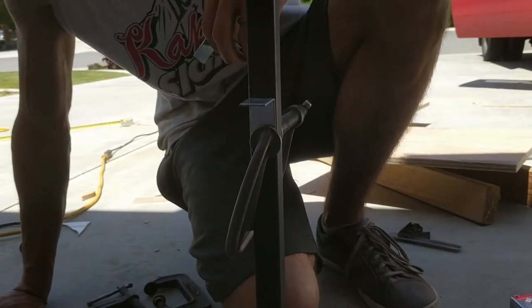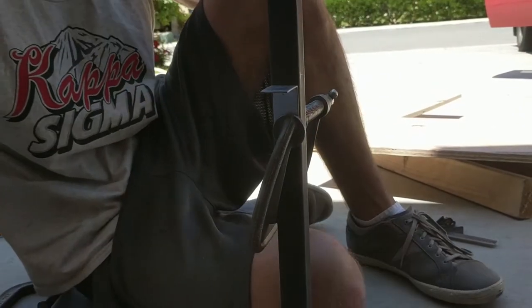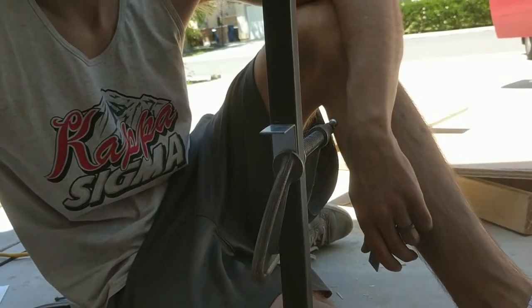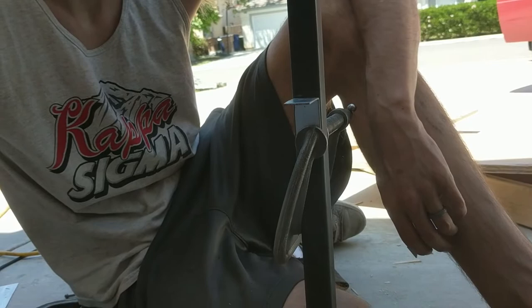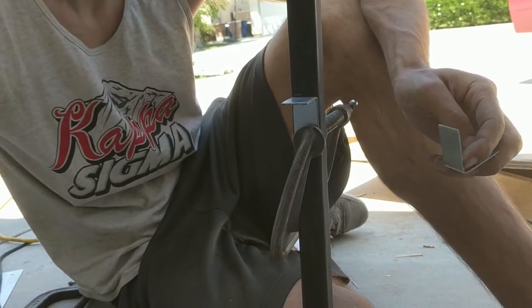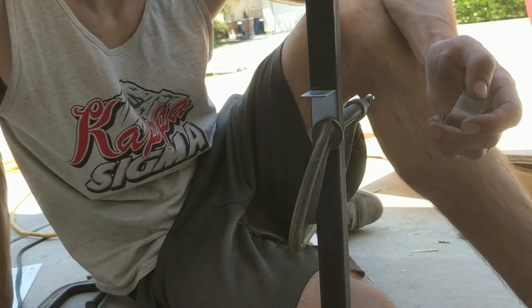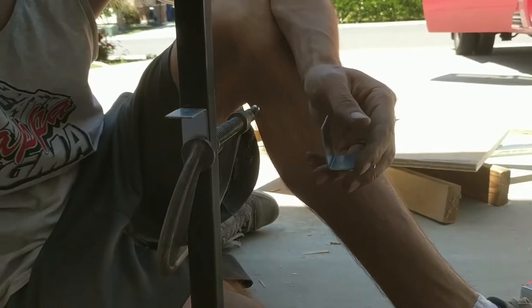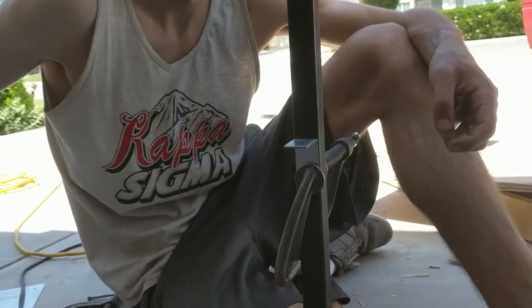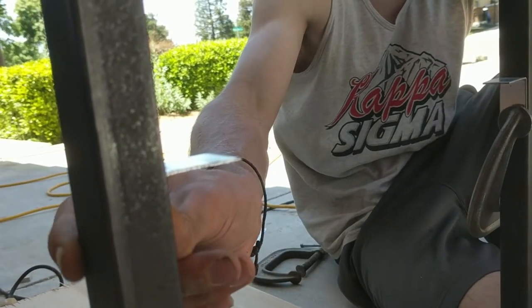So the fireplace stand is made out of 1/16 inch 1x1 tube steel. It's welded together. It's pretty strong. It's actually surprisingly light. And then the brackets are the same angle iron I used to support the cargo dividers that we kept in the van. This is 16 gauge galvanized 1.5 by 1.5 inch, but you could use whatever angle. Just building a platform for this shelf to fit on that Allie cut out.